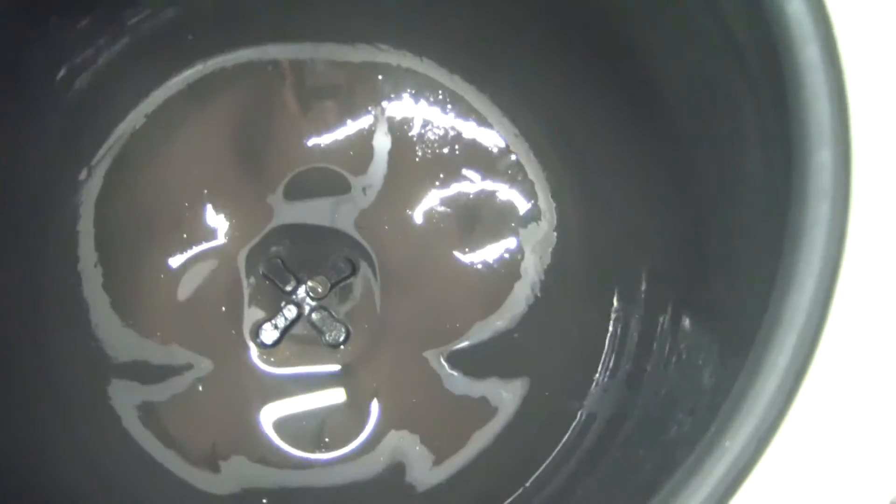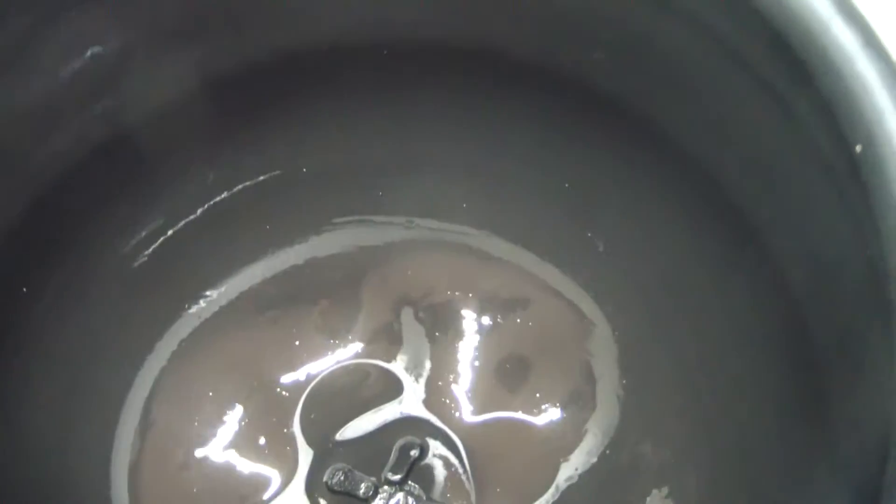You've got about 35 pounds of water pressure on one side and about seven pounds of air on the other side of the diaphragm. As that 35 pounds of water pressure pushes the diaphragm down, it compresses that six or seven pounds of air on the other side even more. Then whenever you hit your little spigot for your filtered water, that diaphragm pushes up and pushes the water back out of the top — that's how you get your water. Let me show you how I cut it and then I want to throw some air on this.